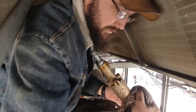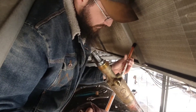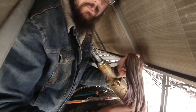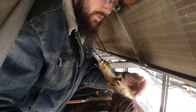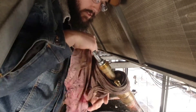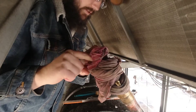I'll clean that up. This is brass to copper and we're having to use the orange — I think this is a 56% silver with orange flux, which is what we use for different metals or non-like metals. What I'm going to do is get my rag more into the body here where all the seals are that we're trying to protect, and try to keep it away from the joint as much as possible. A lot of people get their rag too close to the joint when they don't have to, and it ends up biting them because it takes too much heat away.